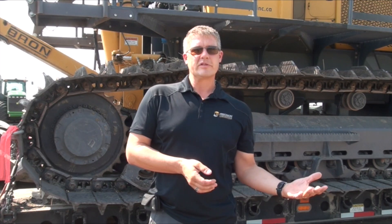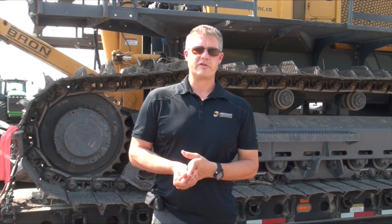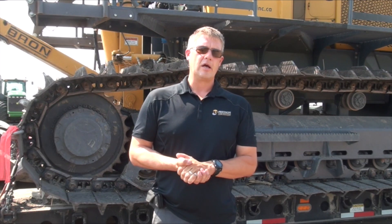It's still less disturbance than the chain trencher, the really old style of installation. But you're left with this rut, this trench that needs to be closed. So what we've been using is a modified disc or blade to bring the soil back in, heap it up over where the pipe has gone in, and then it gets packed down. Through natural settling processes, the soil will recompose itself to have natural stability.